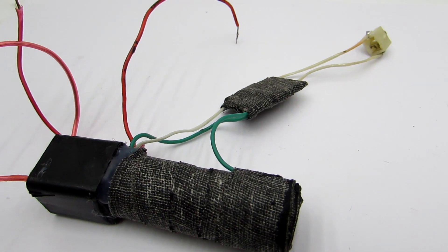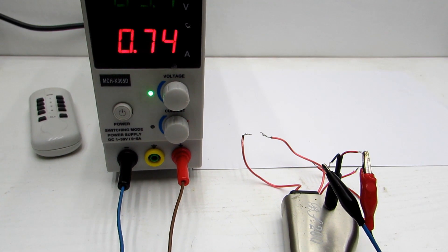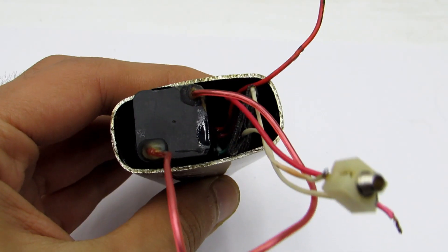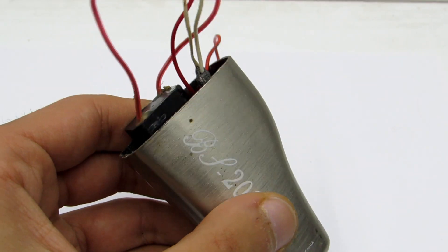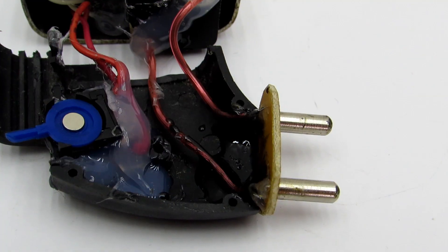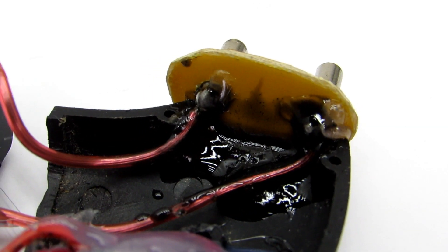This is the full circuit — the protection board, as I said, was not installed. After assembly, carefully check the connections and the work of the charger. Next I put everything into the housing. It remains only to carefully place the high-voltage wires. It is recommended to place them away from the low-voltage parts and from each other. Although they are in isolation, it is better to ensure proper separation.